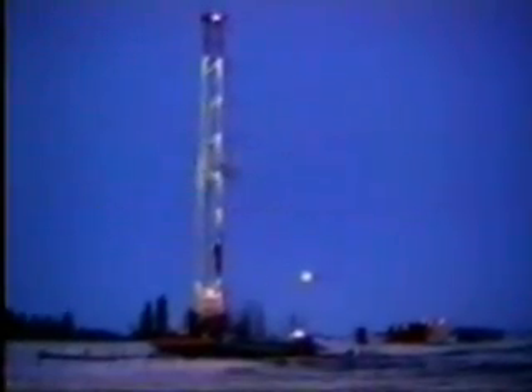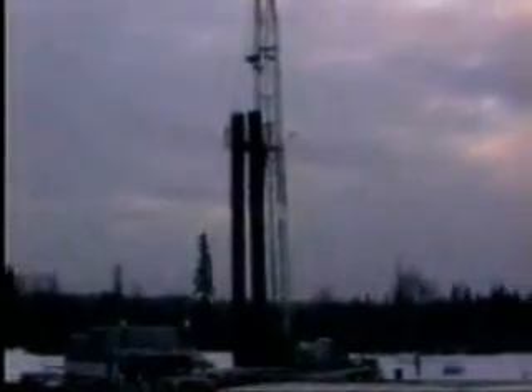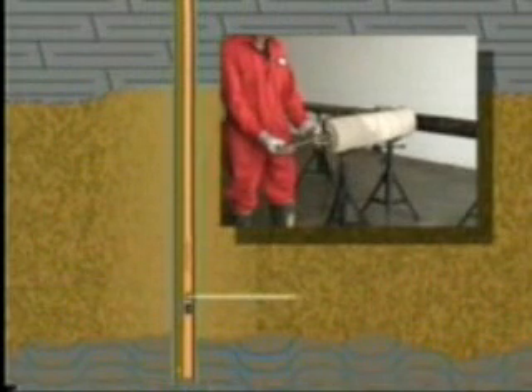The Penetrill system is worthy of consideration as a possible solution. The tool has found good application in wells with skin damage or thin zones with poor boundaries, where further stimulation would be too risky. It has been used to increase the effective wellbore radius, reducing drawdown and helping to prevent coning. The Penetrill tool has proven particularly effective at improving injectivity rates in injection and disposal wells. It has also been used for frack initiation in zones that are difficult to break down or exhibit excess perforation friction pressures. The long, pristine tunnels and the low-force manner of the Penetrill system can be a valuable tool for production companies in their efforts to efficiently draw hydrocarbons from the world's ever-maturing oil and gas fields.